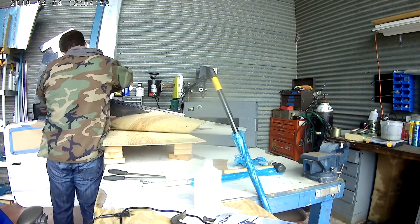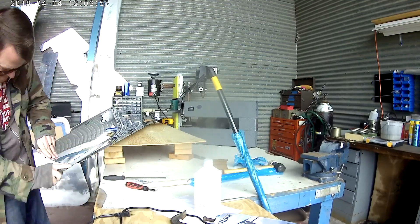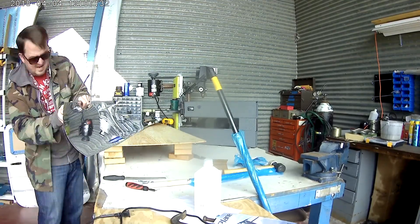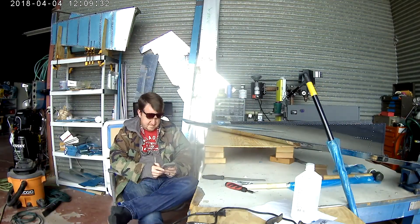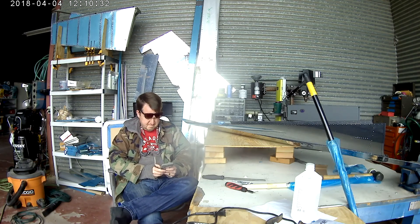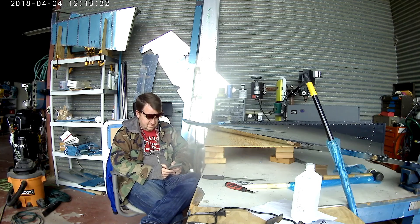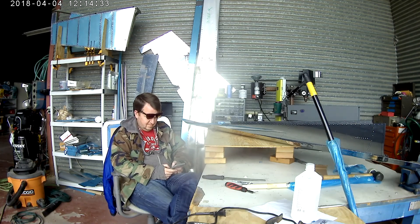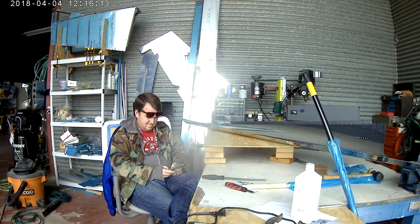Just going to go ahead and deburr both apparently. One lesson I've learned — note to self: stamped curved edges in general have a more frequent stamp edge issue to deal with. It's very brittle and smoothing that out is not easy. I'd use my curved big Craftsman file — it's a coarse file, but it really gets that stuff out quick. It would be a pain in the butt without it.